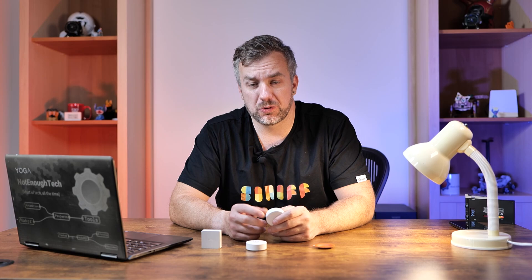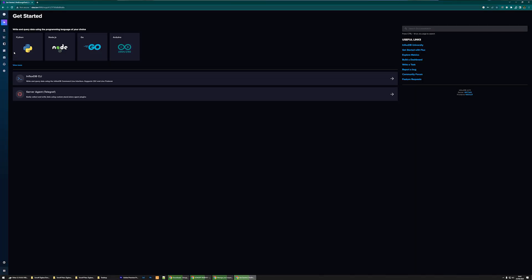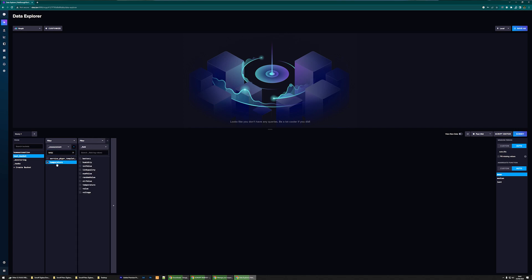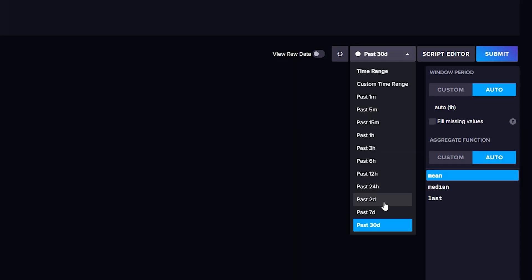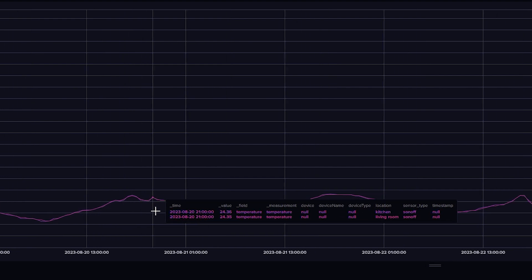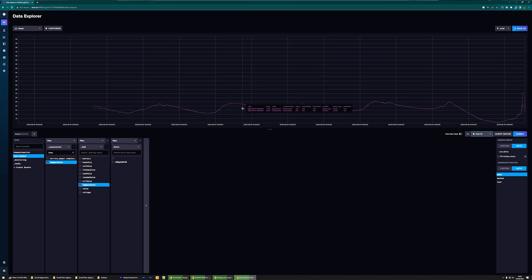You're probably here to find out if it's actually better. I couldn't find information on the PCB about what sensor they used, but the product documentation reveals they use an SHT-40 sensor, which is fairly accurate. I hooked up both sensors, put them next to each other for a couple of days, and monitored temperature and humidity for changes. Looking at the temperature graph, they're identical — reporting in a very similar fashion — so you don't have to worry about discrepancies between the two sensors in terms of temperature. They perform identically.